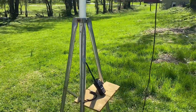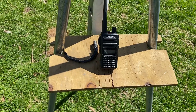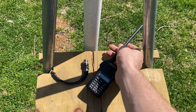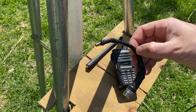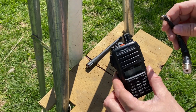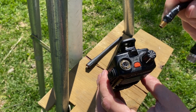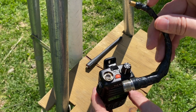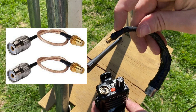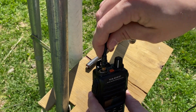So we've got our four element quad mounted up top, and then I've got a little shelf here I rigged up for when I use this out and about for various setups. You can set your radio on it or whatever. What we're going to do is simply take this antenna off the HT. This is an adapter you can get for both the Baofeng HTs and this particular Yaesu FT65 or FT25, the 2 meter only version — it fits its reverse SMA. This one here is taped up because they're crimped when you buy them from Amazon, they don't cost hardly anything — I'll put a link right here. I ended up soldering this one and then just for strength I taped it up. So it looks extremely, as we call in my friend circle, 'Timmy rigged' — but that actually makes it stronger.